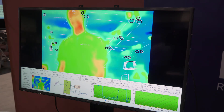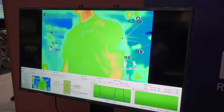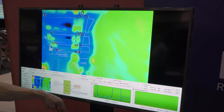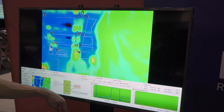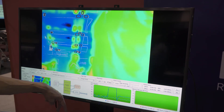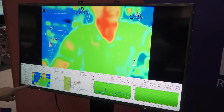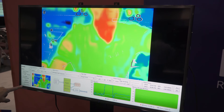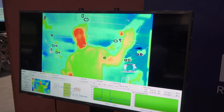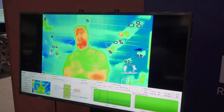The alignment of the two images consists of not only resizing the thermal image, which is very small, but also warping it. Because we have two cameras here with a parallax effect — the fact that they're pretty wide apart — we need to correct for that. So it's a calibration phase that's done in software, done manually here with this little interface. As we can see, if we don't do the warping, the two images are misaligned — we're not quite matching up the thermal content with the visible image.